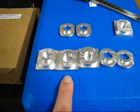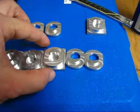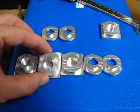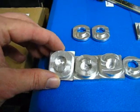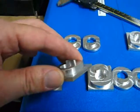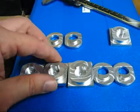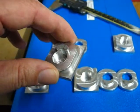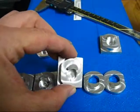Here's the first one, the second one with the attempted chamfer, and the third one where I put in some finishing operations. You can see the differences here — this is with all roughing operations and no finishing operations. There's an edge on there for the chamfer that was badly done. I didn't have the corner radius of the end mill entered correctly, and the finishing operations definitely lead to a better finish.